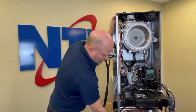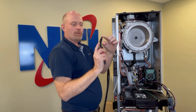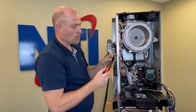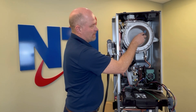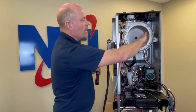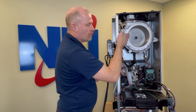Scrub and flush until you think you've got it clean. Take the NTI cleaning tool and slot it in between the tubes — it goes in about an inch and a half, which is the full depth of the tube, and that needs to be clean right to the outside of the boiler. This tool was developed because the old credit card method no longer works — the tubing gaps are a little smaller. It's about 26-gauge steel. Note that there are dividers every few inches, so you'll have to remove the tool and insert it next to the other divider. Once you've scraped all around, use your cell phone with the flash to take a photo down between the tubes to verify it's indeed clean.